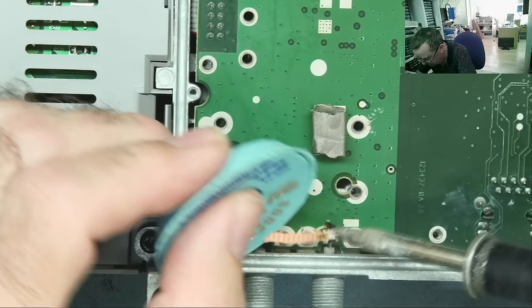I can see diode junctions there, that makes some sense. And let's even find this chip. So it's an ST. It might be this number. That might be a date code, but let's have a look. Well, I Googled then, as I said, L8 SOT23 SMD code brings me to smanuals.com.